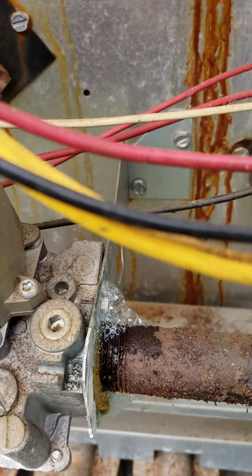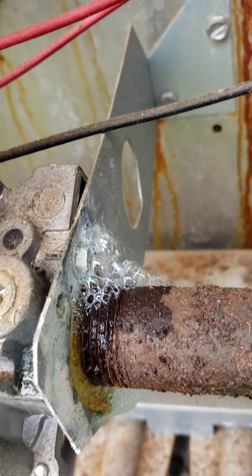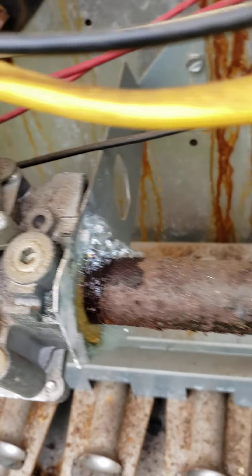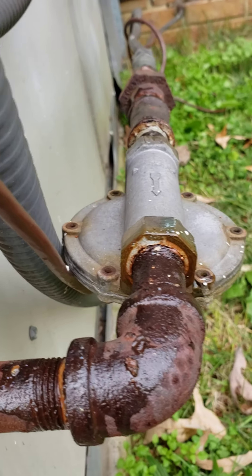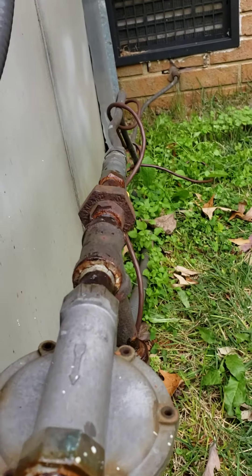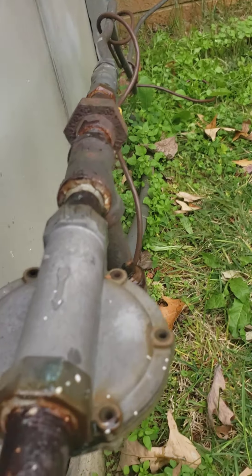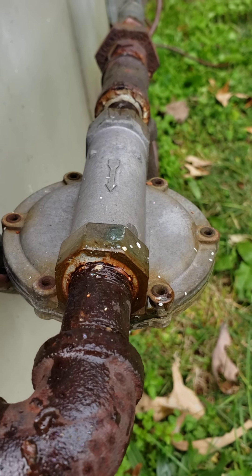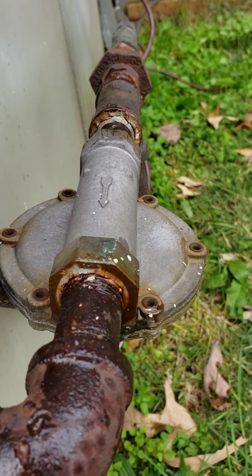So now what I'm going to do is repair this leak. I'm going to replace the flare-tight elbow, nipple — I'm going to replace everything back to the shutoff valve: union, t-trap, two-pound regulator. Should work after that, no worries.